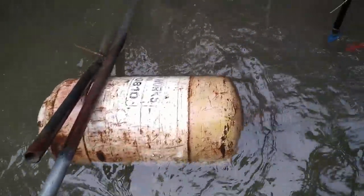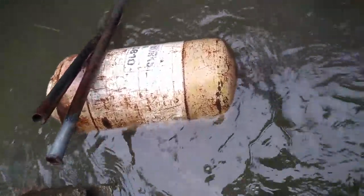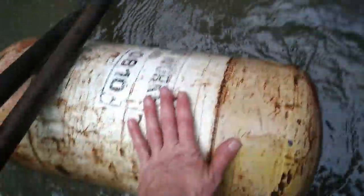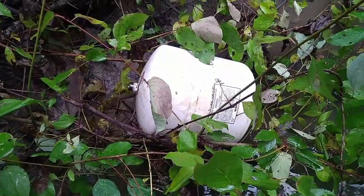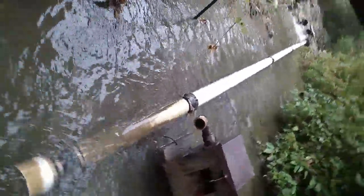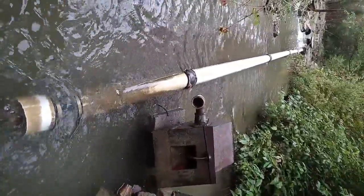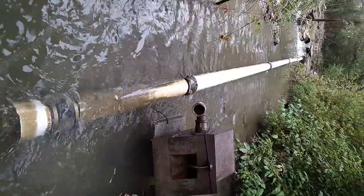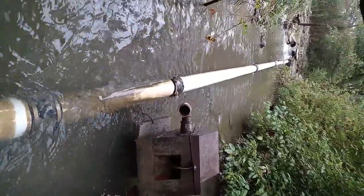Here's the big tank — I think it's a 25 to 30 gallon propane tank. I have my fittings sitting on here. This is for the check valve side, exit side, water reservoir, and then we've got the air tank that sits on the end of it to maintain the constant pressure. So I'm gonna reset up my delivery valve because she moved a little bit — you can see it's got the snake effect going on there. You always want to keep these as straight as humanly possible and obviously always on a downward slope. So I'm gonna straighten these up and get right back to you guys.